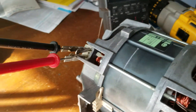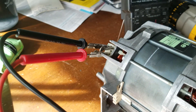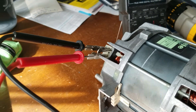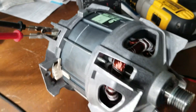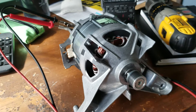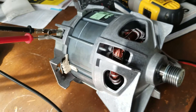My conclusion is that this is actually a sensor for the controlling circuitry to understand how fast — how many revolutions per minute — this motor is going, for its feedback loop to be able to control how much power it sends to the motor so that it can keep within an established RPM.